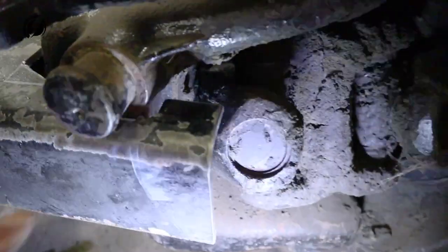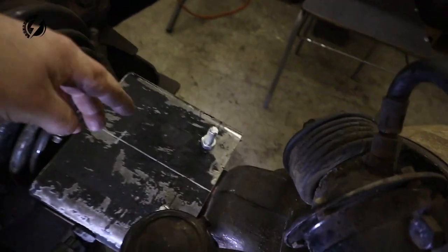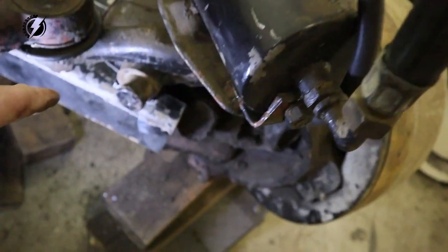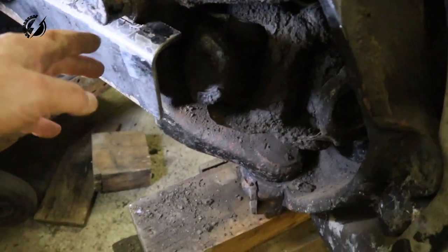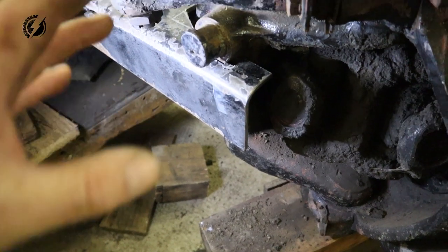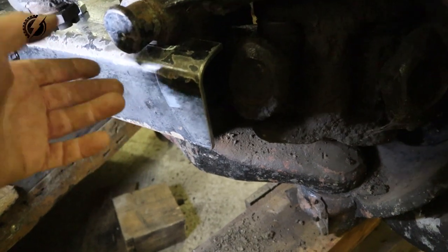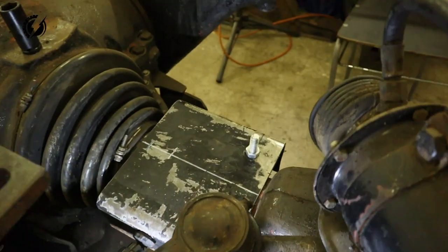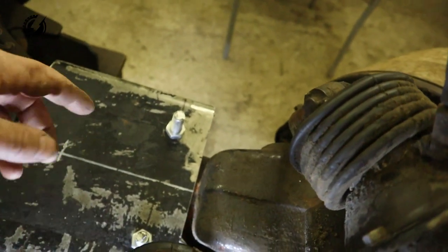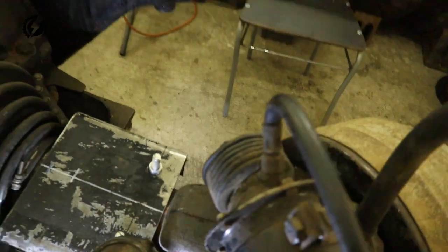It still touches over here. I'm running into a problem because I tried to have it in the middle, which it probably already is, but I will cut a little bit here so it will not touch, so I will know exactly that it's in the middle. But I don't have enough material over here to put the U-bolt here. So what I'm going to do is use this part only as a template — the one I'm actually going to use will have holes offset a little bit.